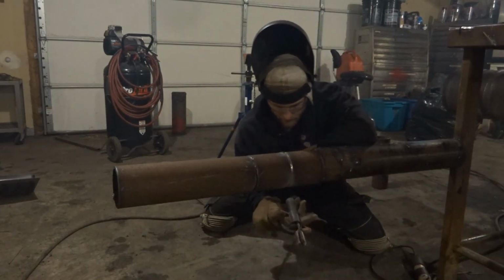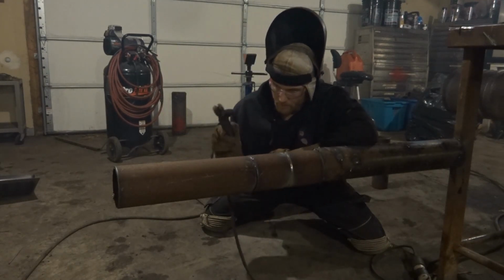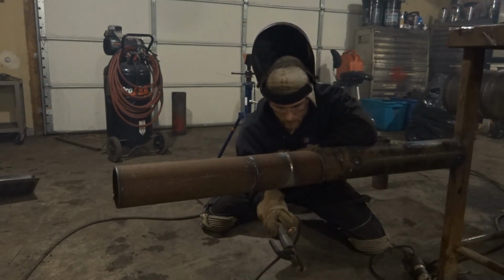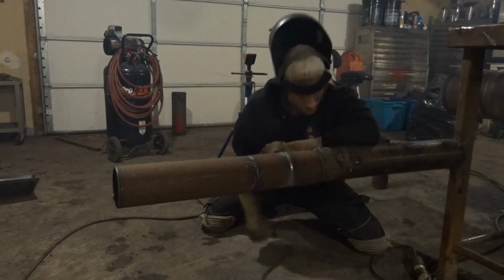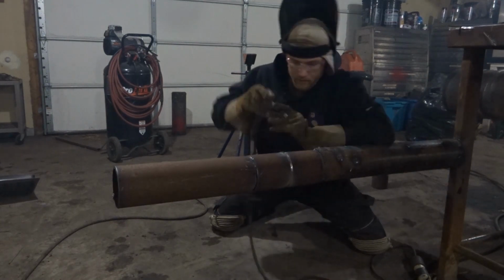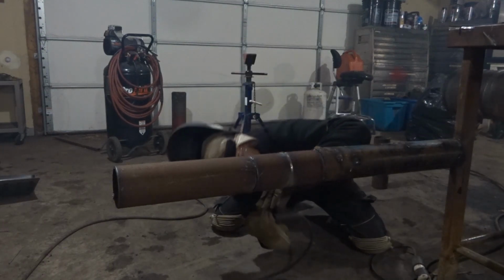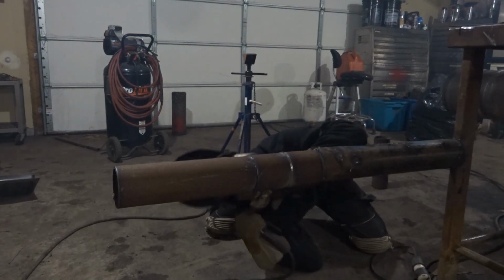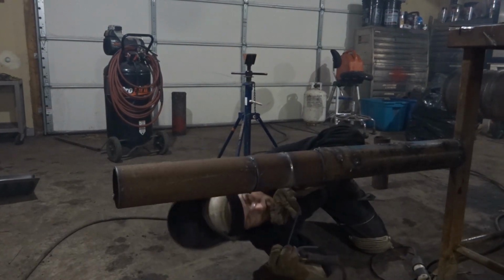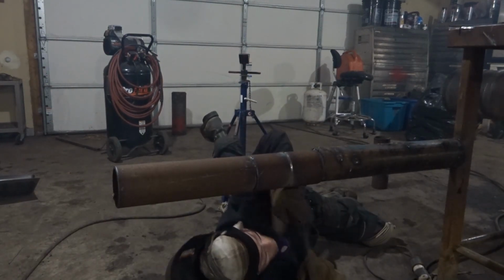The electrode is the stinger pointing away from me as I go up. Sometimes we'll see guys holding the stinger like this, and see when I get down, they still have the arm like this, and it kind of screws them because the whole arm's gonna get under the pipe, the whole body's gonna get under the pipe. See what I mean?